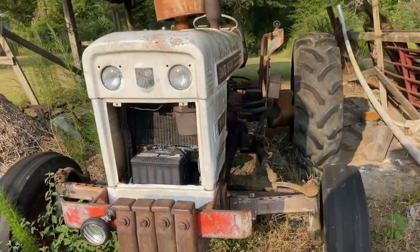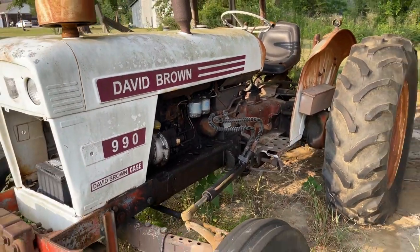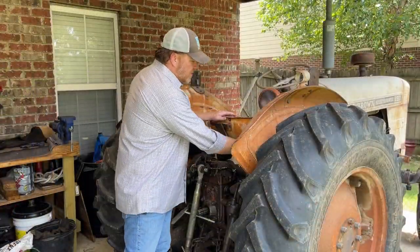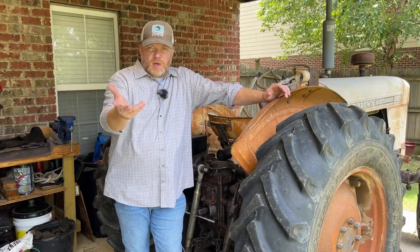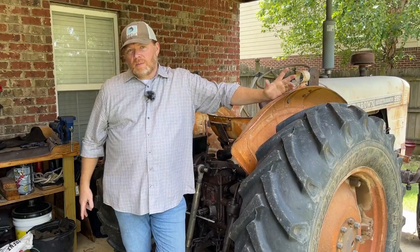You may have heard me reference in some previous videos that we have another David Brown 990. The other one is a '73/'74 model — it's actually got 'Case David Brown 990' on the side, so it's after Case bought them. It's down at our home place. Like I've said in other videos, it has a stuck spool valve, and I'll need to go through it — take all the hydraulics off, get the valve chest out, and get that spool valve rectified. I'll probably be videoing a lot of that, though I won't go into a whole lot of detail since I've already videoed most of it. The Select-O-Matic system is pretty much the same across tractor models, but where it does differ I'll make some video. That may be next year by the time I get to it.